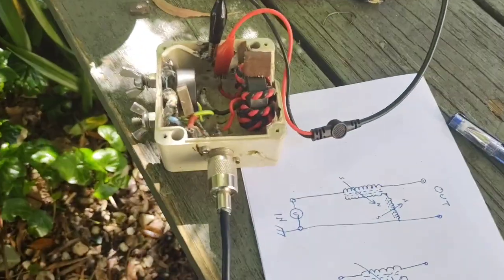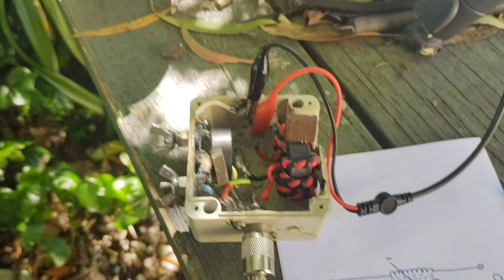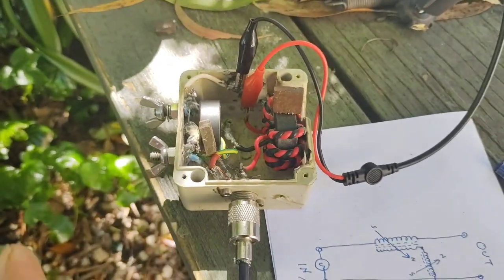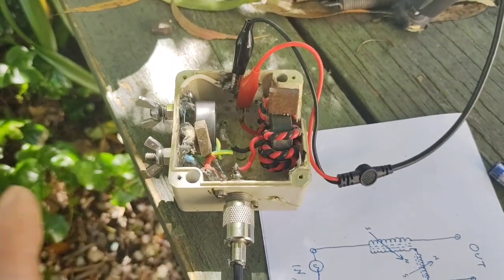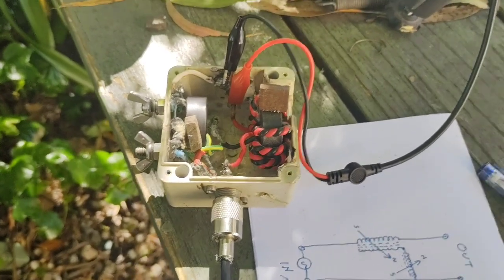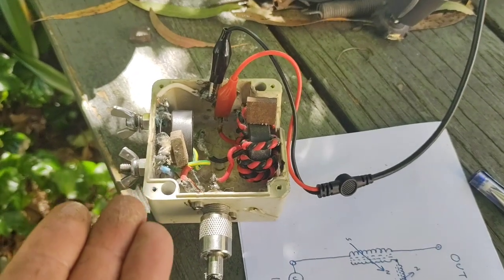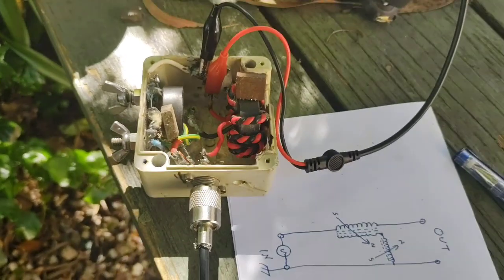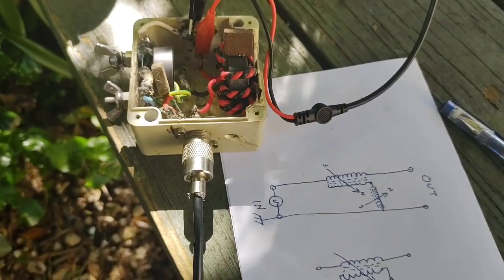There is one more thing I must warn you about: you can often get more than one match. Don't just assume that a low SWR means you've got an effective transfer to the antenna — check that with a field strength meter. Because you can get a match that doesn't transmit at the antenna; a really diverse tuner can tune into itself.